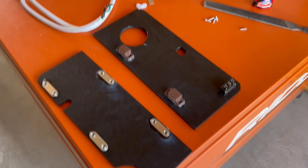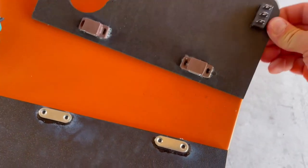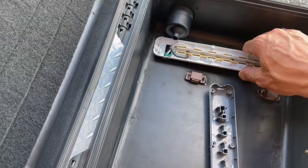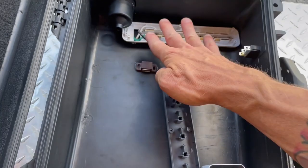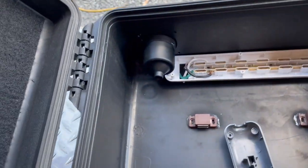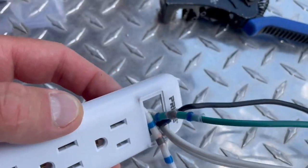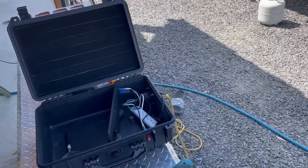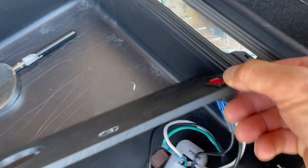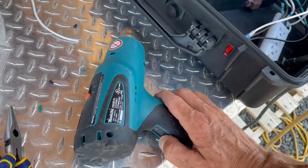It's coming together now — the parts are all put together and I'm in the wiring phase. I've got my breaker in there, all my magnet spots on that, and this part over here fits perfectly. I didn't have to cut it down — boom, my switch is in there. Now it's just time to wire — the fun part. I got all those wires extended and run. It works — it's all wired up. Power comes in here, goes over to the switch, then to the breaker, then down to the power switch, and we've got on and off.